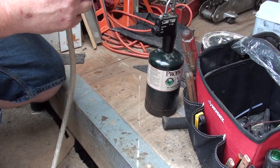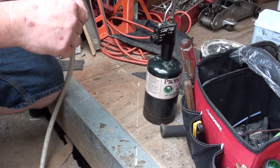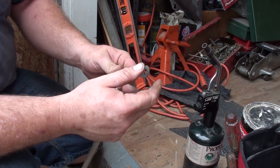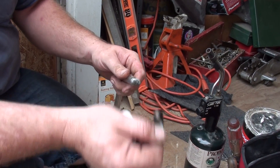You ever have these problems when you come along after so many months, you go outside, if you never check your ground terminals or whatnot, always be sure to check them, even if you have soldered them. They have a tendency where the solder breaks down over a period of time from weather, no matter how much solder you put on it, and it'll just pull right off.